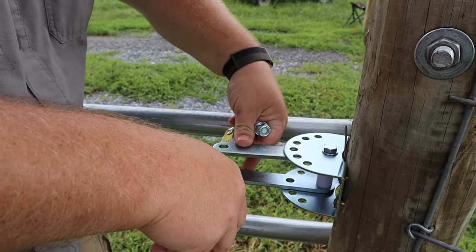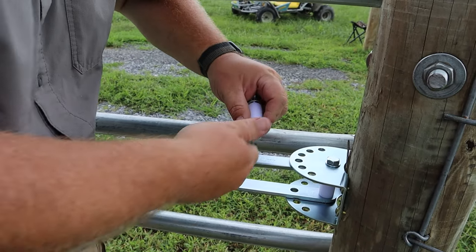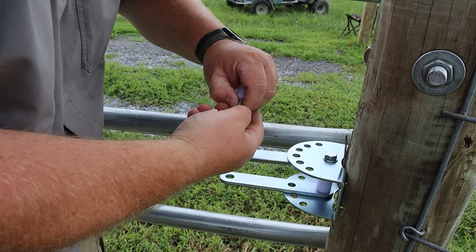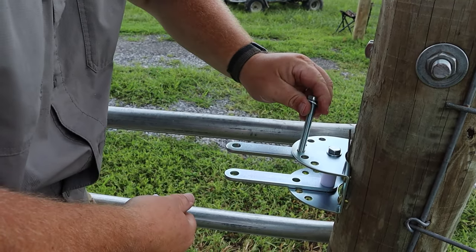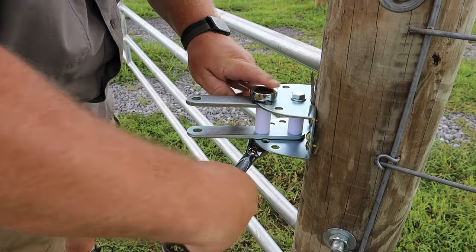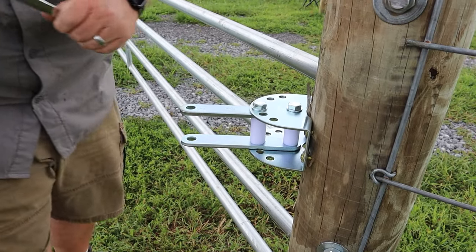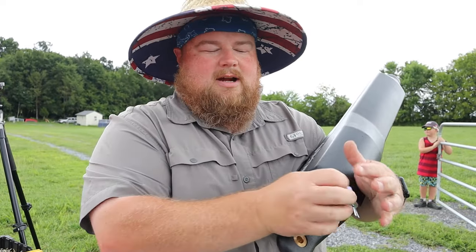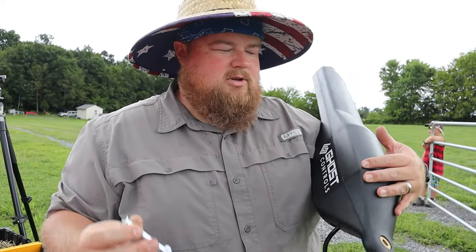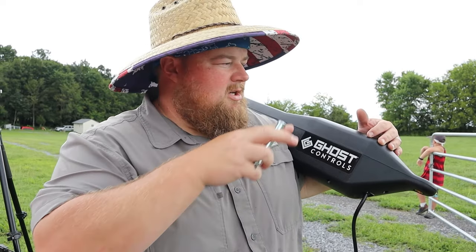All right, so approximately 4 inches from our gate puts us at that right there for our second bolt, nut, bushing combination to go into place to change this from a pivoting bracket to a fixed one. We have our bracket mounted to the post. Now we use our hinge pin and bushing, the cotter pin and everything, and attach the actual motor or linear actuator to the hinge pin on that post we just mounted.